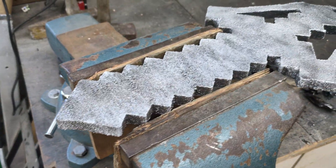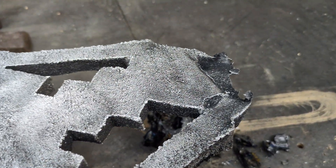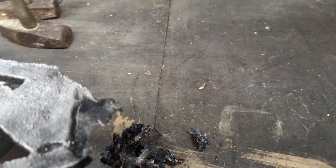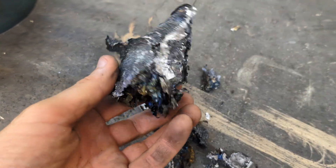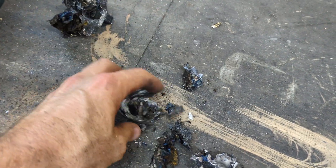A lot of people always ask me why I coat my foam with gypsum — well if you look at the surface finish, it's pretty horrible without it. Also, as you can see, this wasn't a perfect cast — it didn't get the very top, and what was left in the pouring cup on the top is just a bunch of garbage.